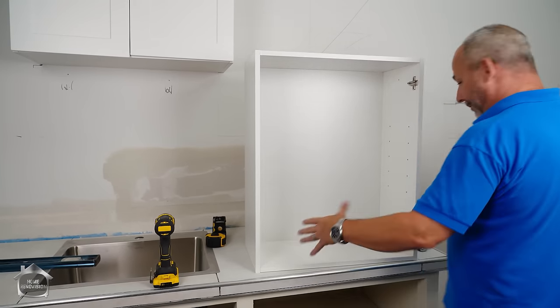Okay, there we go. Right now the bottom's still way wacky. See the door, it has movement. We want to make sure that it closes together. Now the bottom is closing before the top. There, now they're both closing together. Right here I got a nice 1/8, and then the door is actually hanging out further than the cabinet. You can see this gap here is widening.